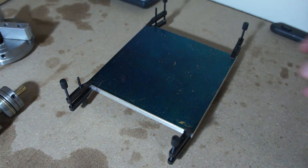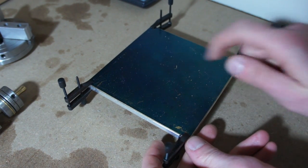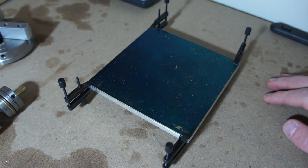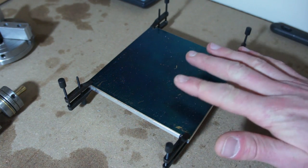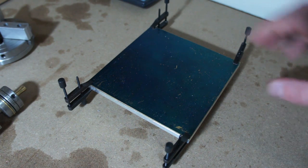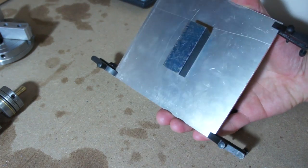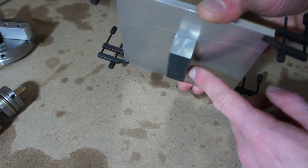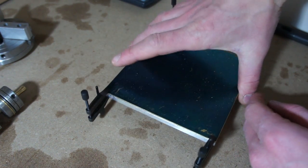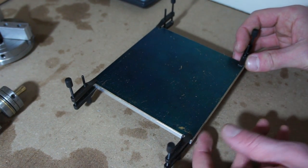This is still a work in progress, but this is actually a project for a friend, and I needed to CNC mill a big piece of brass very precisely, like all across its length. So any kind of deviation, a few thou here and there, you end up with deeper engravings, and if they're fine cuts, it kind of looks silly. So I made this. It's a big aluminum plate, and then on the back I just put a steel block that I tapped in there, and this clamps into my little precision vise, which then clamps to the CNC bed, and then on top there's a piece of brass you can see, and then I just have these little machinist clamps holding it on right now.